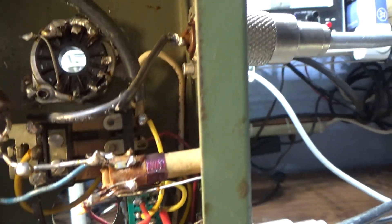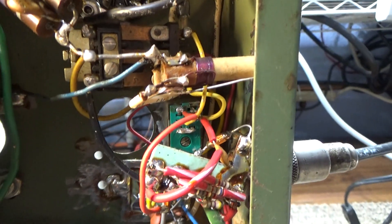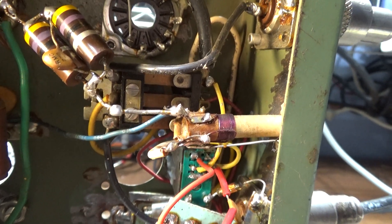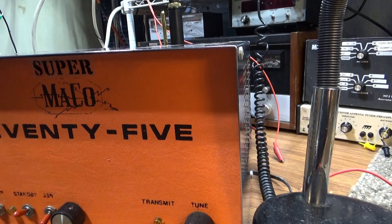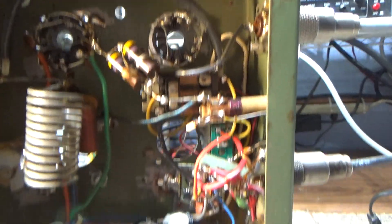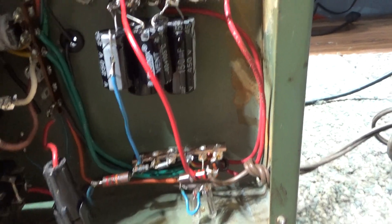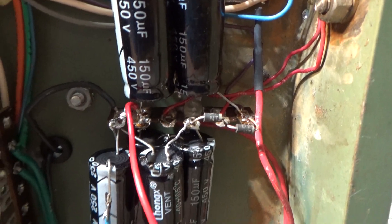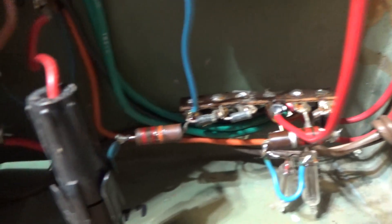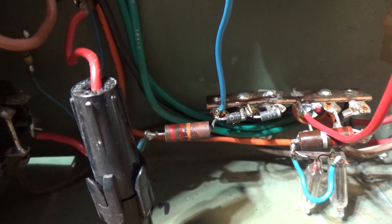On this Super Mako 75 they vary the bias, but this one has fixed negative bias and uses the input. We tested it and the dead key can go anywhere from 0 to 25 watts on this one, and a two-tuber would double that — 0 to 50 watts dead key. The two M2057 version swings about 500 watts. Curious what this one will do with the 8950 in it.